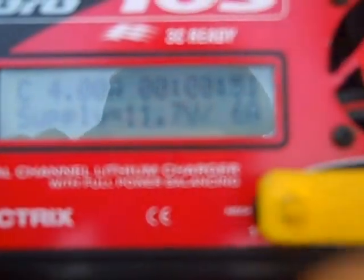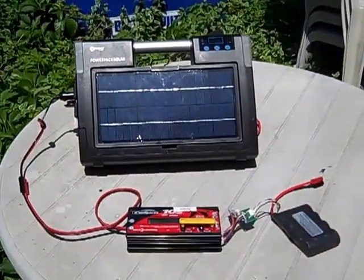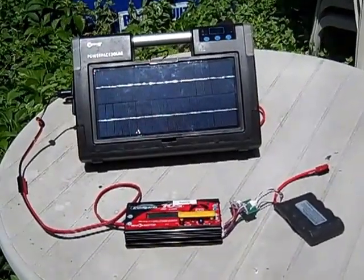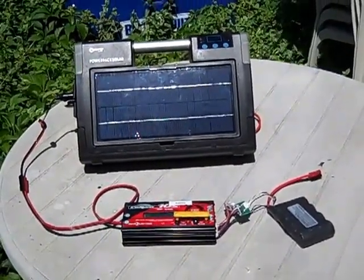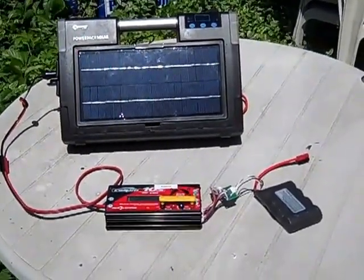You can see that if I look at the mode, I get about 4 amps out of this. It supplies 11.7 volts at 4 amps — pretty good. It's not a great setup for portable use, but it is good for something like Field Day, which is what I will use it for this coming Field Day. So now we'll see what else we can do with different kinds of solar panels.